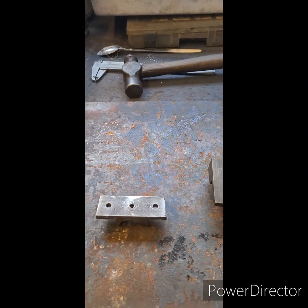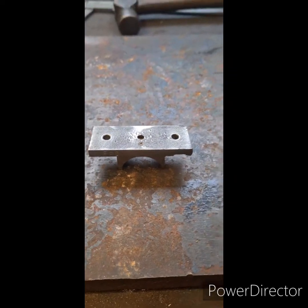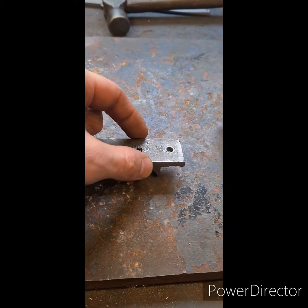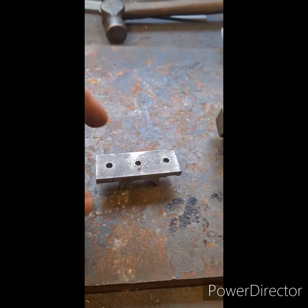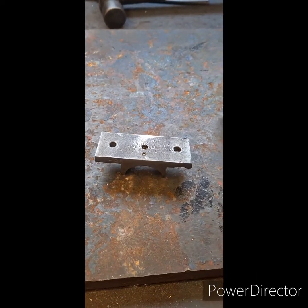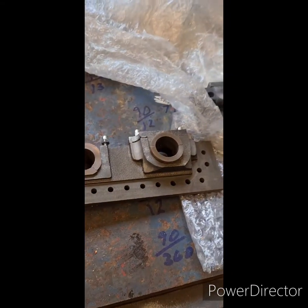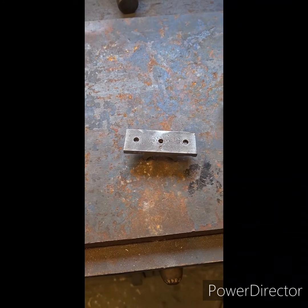price this time. So in the interim, I'm going to start working on these, the bearing tops. These have oil pots built on top, and the gear sliders slide on top of these. So yeah, I'll be working on them. I've got 4 to do, actually 3 to do. One of them has an oil pot on it because it doesn't have a slider. So yeah, just follow along.